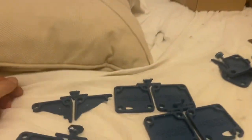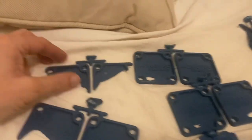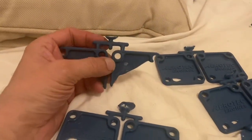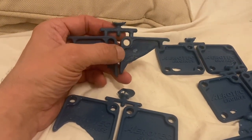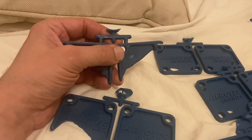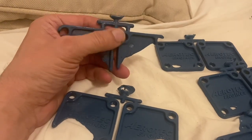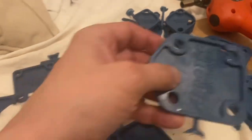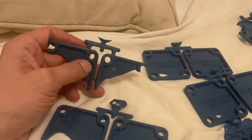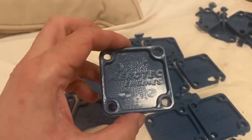When I have 260 degrees on my plastic and it's been in the crucible for at least five minutes, and my mold is at 60 degrees, then the only variable left is pressure. I personally have not shot any of my molds below 70 psi. Tonight I'm running at 70 or 75 psi — that's the lowest I've ever run. These parts over here run at 100 psi and these ones at about 90 psi. I use a lot of pressure, a lot of temperature, and a lot of heat, and I get a good product that fills up nicely.